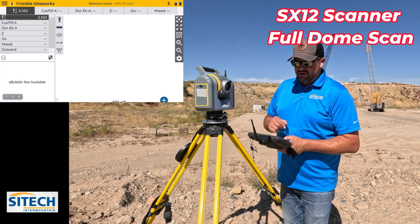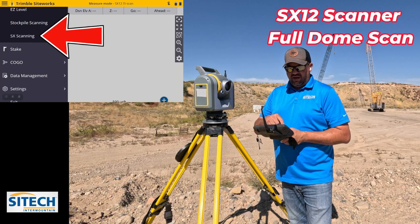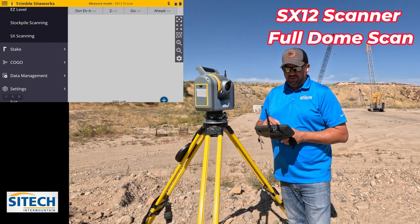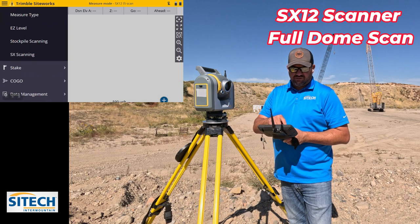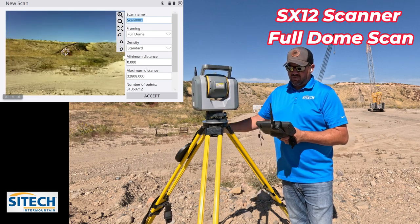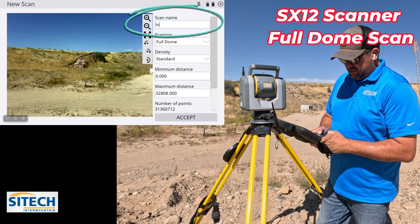So, knowing that it's going to do all this scanning for us, if you notice in your menu button here, as you go down through that, there's some different settings in here that aren't normally in there if you're running an SPS 930 or GPS. Underneath this measure option is an actual SX scanning option. In here is where you can actually set it to the settings you want. We'll go right down through this. So we can call this a scan name. I'm going to call this the hillside.